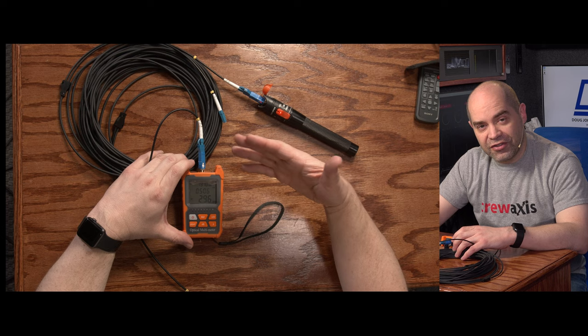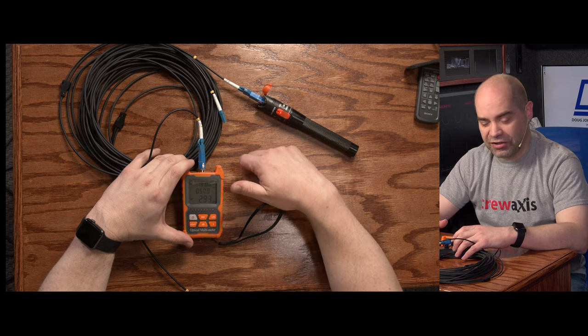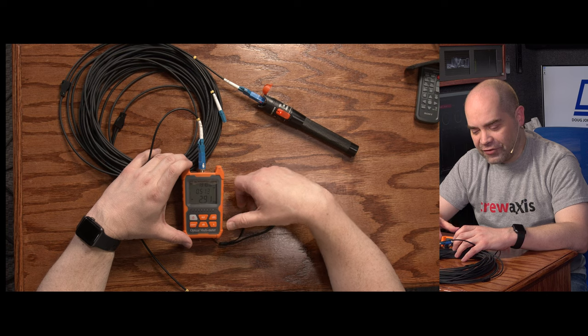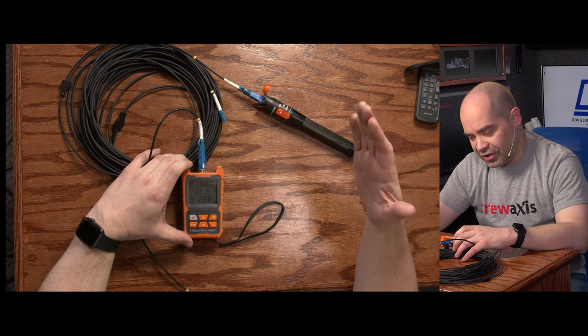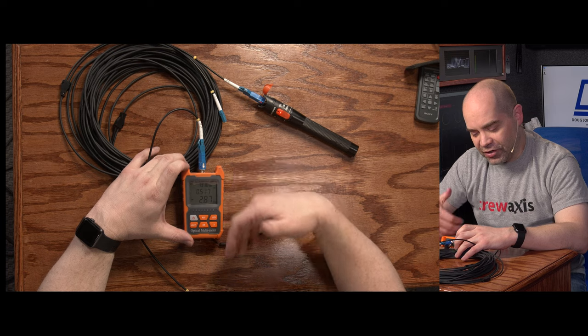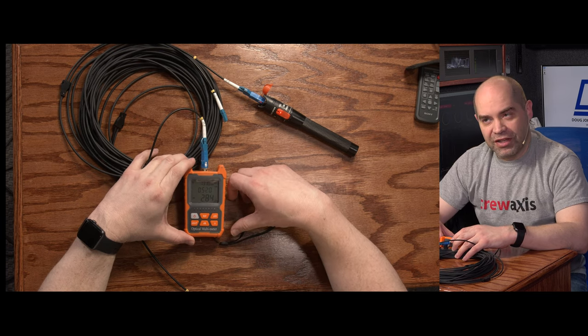A related tool is an optical power meter. You put the adapter on and it shows you on screen the loss — in this case about 2.5 decibels of light from one end to the other. This helps you see how well your cables are actually passing signal, not just if they're passing signal. It's been very helpful for figuring out which fiber cables are working well and which are more iffy, and for taking damaged ones out of service. You can also see the effect of cleaning an end, because that can make a big difference. Together these two tools are kind of indispensable for troubleshooting fiber, and the combination cost me less than $100.